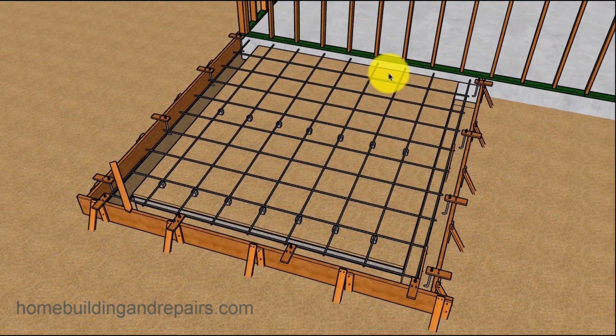So that is it for this video here. Rebar, anchor bolts, footings. Simply pour the concrete in here, strip the forms, and then you are ready to start framing. And anchor bolts, of course, I didn't go over the positioning on them, where they need to be positioned, but they do need to be positioned to where they're going to miss the wall framing studs. You're going to see more of that in the next video.